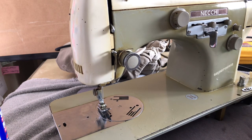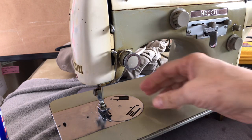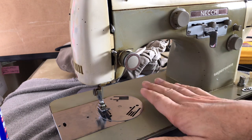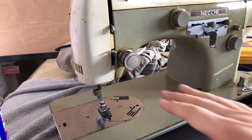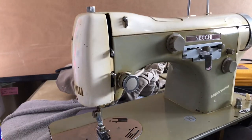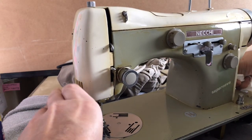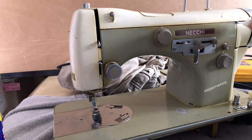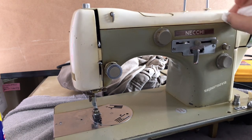If you don't get all the glue residue off at once, it may take stages — because every time you remove some, you enhance the ability of more sewing machine oil to penetrate the remaining adhesive. I've gotten a lot of this up, but it may take multiple passes. Now let's look at those cleaners I haven't let sit very long on the top of the machine, so they may work at different speeds.